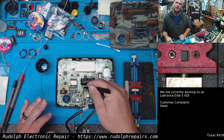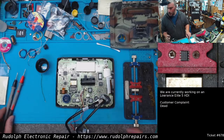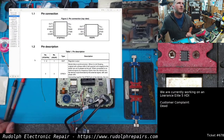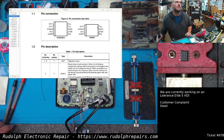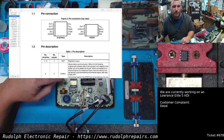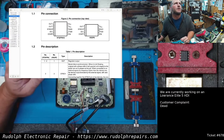While that chip was still soldered on, we pulled up the data sheet. Looking at the diagram: pin 1 is output, pin 8 is VCC — that's the incoming unregulated voltage — and pin 7 is ground. So if we take our probe, ground the black probe to chassis or board ground, and take the positive probe to VCC, we have our power supply still plugged in.